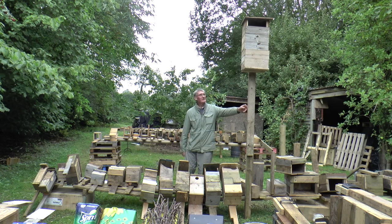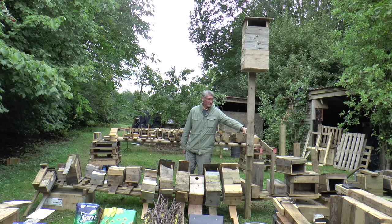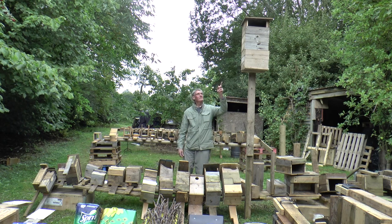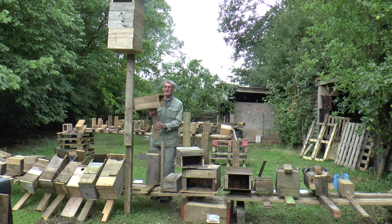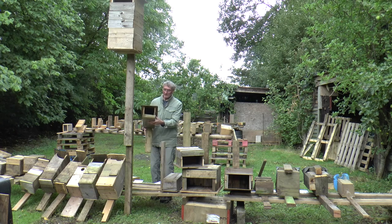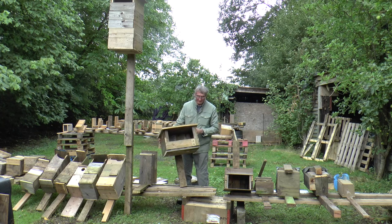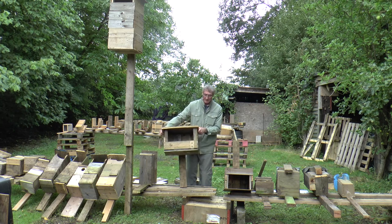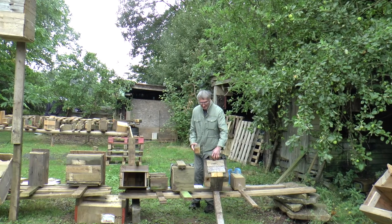If you don't want to be going up a ladder to hang a box for an owl or a raptor, and you have a good solid post, put the nail at the bottom and then swing the whole thing up so the entrance is now three metres up and you can be standing on the ground. Some birds like nest boxes that are more horizontal — like the wagtail type, a bit bigger, possibly suited to blackbirds. It would be good for raptors and owls. Also, if it's at ground level at a pond, it would be suitable for ducks and other birds. This entire box is made from fence posts.